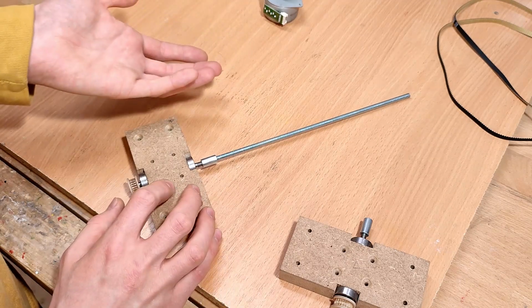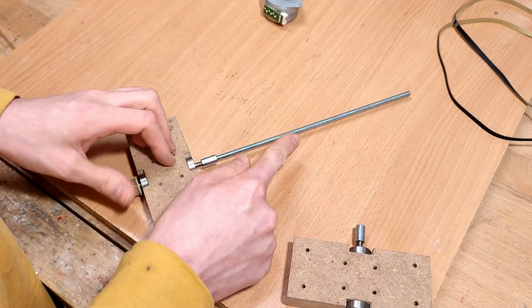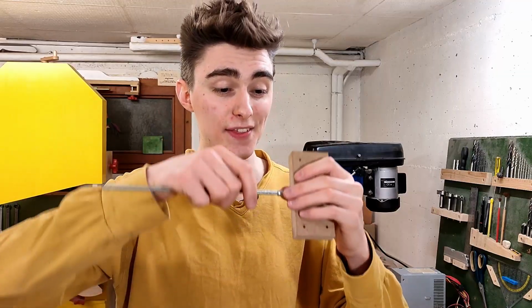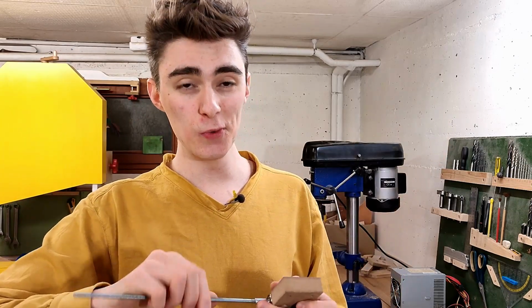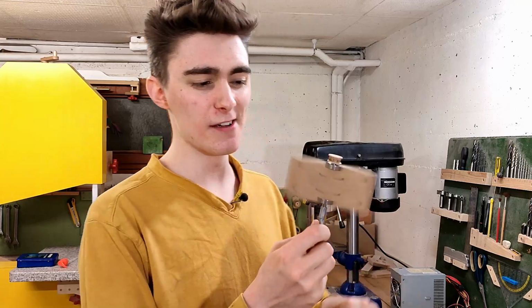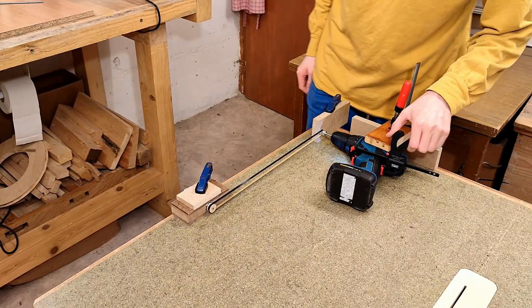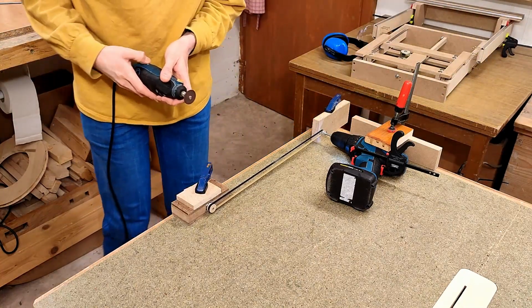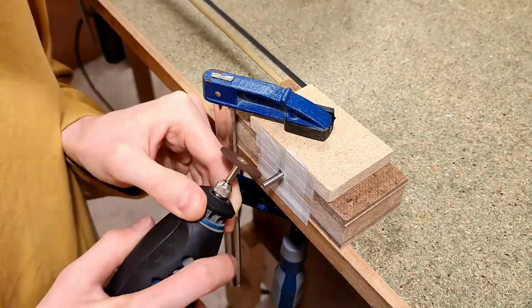I wanted to deal with that another time and just ignore it for today, but that's just not going to work, is it? Even worse is the fact that this connection with the coupler nut constantly unscrews at the lightest touch, which wouldn't be so handy during printing. I really didn't give that too much thought, did I? The easiest way I know of to fix this right now is to spin the arbor on those very bearings, just like we did for the pulleys, and grind away the thread until we get the shaft to actually run true.